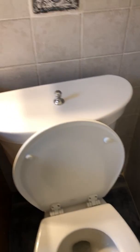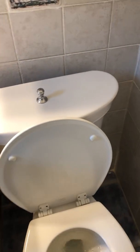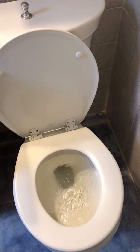So here's the lever. You actually have to hold the lever up in order to get it flushed, as opposed to just pulling it. It doesn't do much for you. So there might be a little tweaking you need there. Again, these are things you want to look for. Every toilet, every bathroom is going to be a little bit different, so never take it for granted.